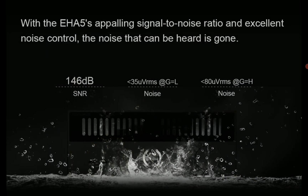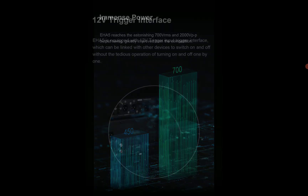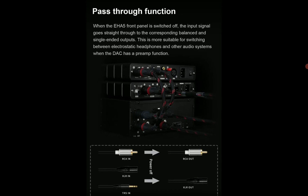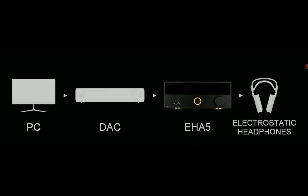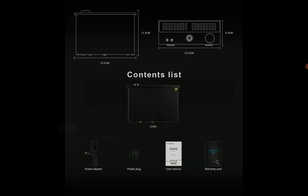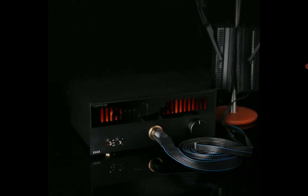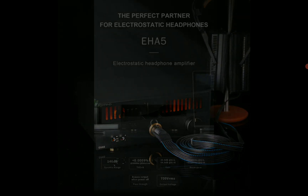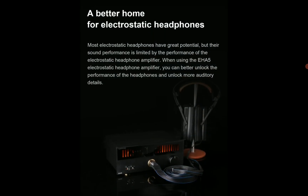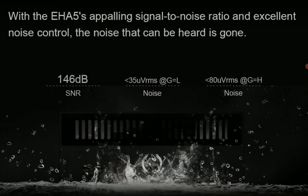It does have a lot of power — 700 RMS of output into those headphones. In fact, it goes as high as 2,000, swinging between 700 RMS and 2,000 depending on what it's plugged into. It has a lot of power output for electrostatic headphones, with 30.9 dB gain in low gain mode and 44.9 dB in high gain mode.